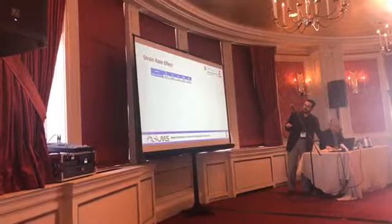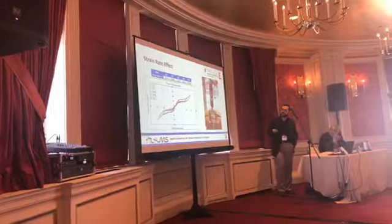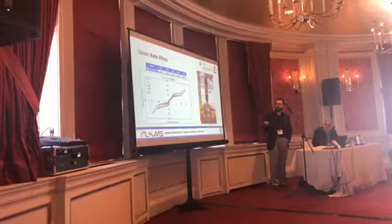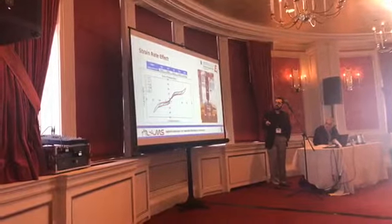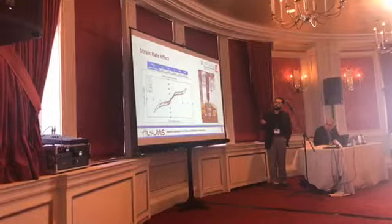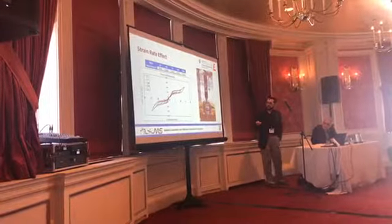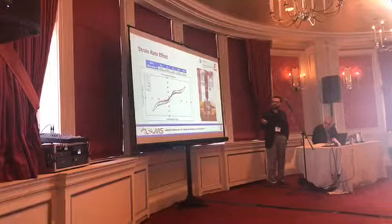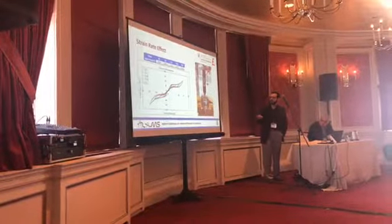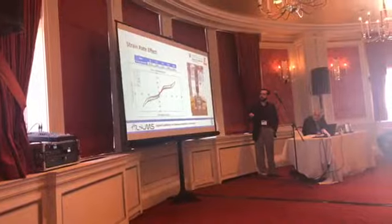So as I mentioned, the next step was to conduct different strain rates or load rates on the system. We started from the initial rate, which was 1 inch per minute, and then we went all the way up to 50 inches per minute. At each stage, we could always achieve self-centering behavior. The test was done on the very same specimen without maintenance, without doing anything.